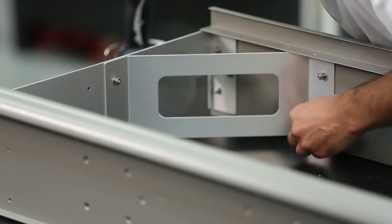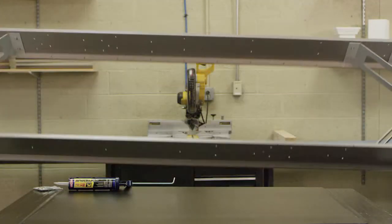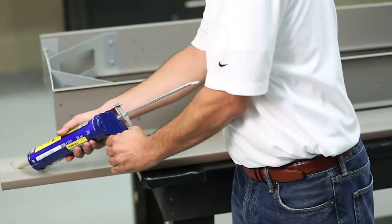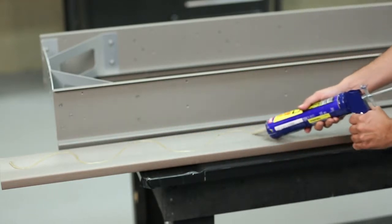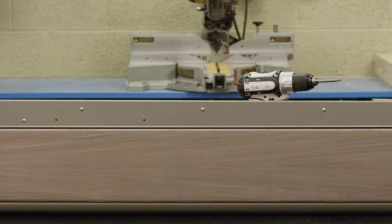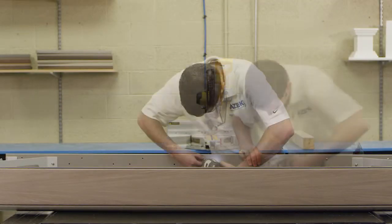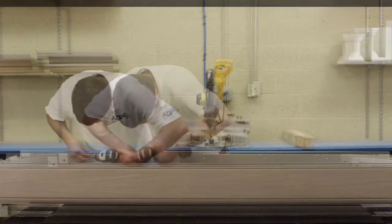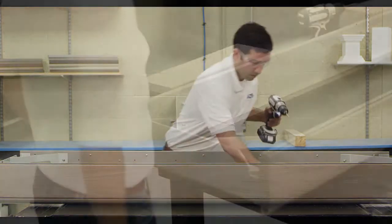The next step is to assemble the deck boards on the bench. To begin, flip the bench bracket unit upside down and lay the 2 long boards down on the sides. Apply exterior construction adhesive to the back of each board and then fit it flatly against the outside of the bracket unit. Using a 3/4 inch panhead wood screw with a sharp tip, fasten from inside the unit, through the bracket, and into the board. Insert screws along the entire length of the board in each of the holes provided in the bracket.